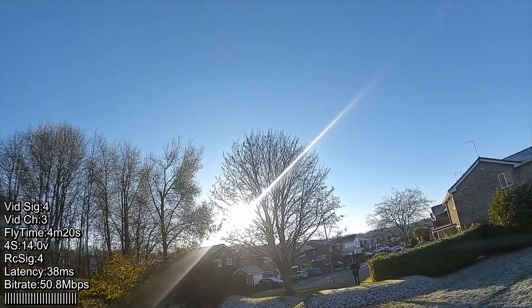Let's compare it with the latest version of the Walksnail firmware — V29 something — which will probably be out of date by the time this video comes out. Now in Walksnail: I'm in 720p resolution at 25 megabit, which supposedly is the best option everyone recommends. Straight away the picture is really clear, but I'm noticing that smushiness on the grass — that compression there.